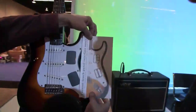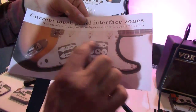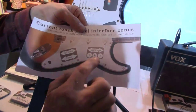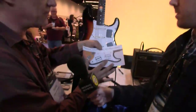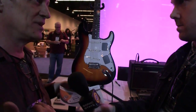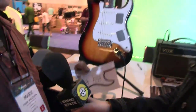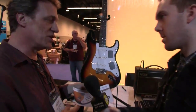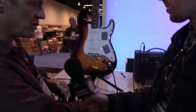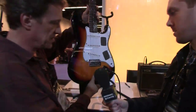We made a diagram because in the software you can set up the configurations any way you want. You can have pickups A, B, and C or B, C, A — any order. You can have the sliding feature, individual discrete areas that turn things on and off, or you can have an X and Y so the entire touch panel becomes a blending algorithm. Here we have volume and tone, but it could be volume and volume — a fast volume or a slow volume. In the software setup you configure the panel and all behavior, then save and upload it to the guitar, then unplug the USB.